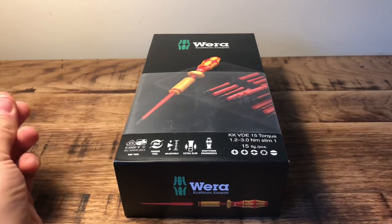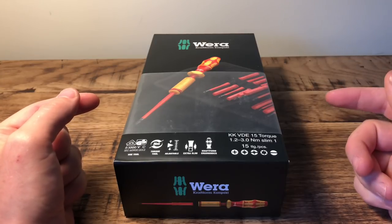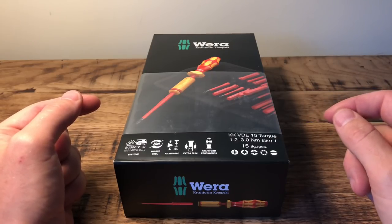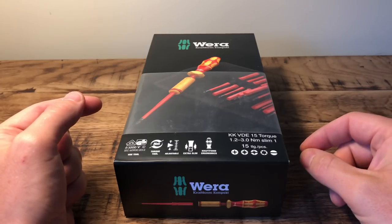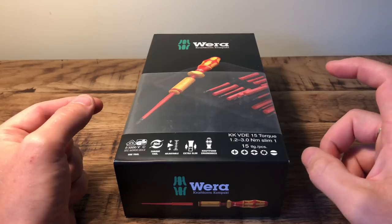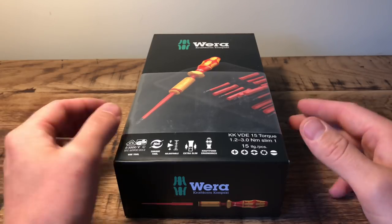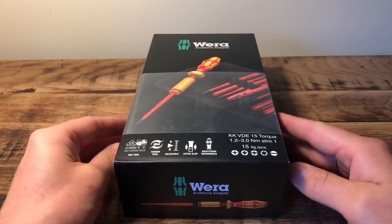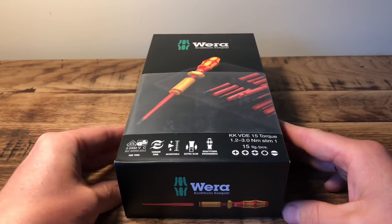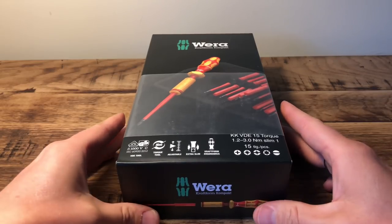This is exciting. You've probably seen in a lot of the comments on my YouTube videos, when I've been installing new consumer units, that I've been really slammed for not using a torque screwdriver. To be fair, those comments had some value because it is really important to get the right torque when you're terminating cables into circuit breakers, RCDs, and things like that, where the manufacturer has given a certain torque setting. So I went ahead and got myself one of these — it's from Wera, an amazing brand of tool manufacturer. It's a kit, and it cost me about 100 quid on Amazon. There'll be a link in the description if you want to get yourself one.